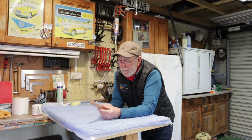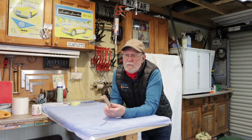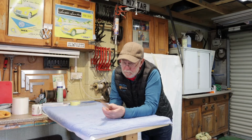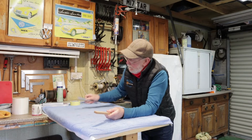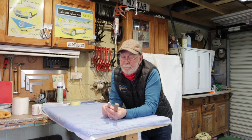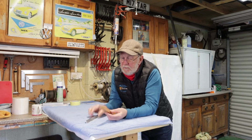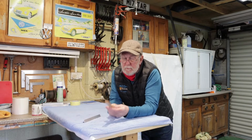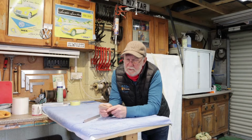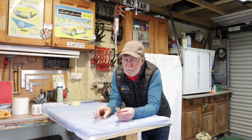Good afternoon. So here we are again now on our mini saving tips. So I'm going to try and make a spot leveler. The leveler is going to be made out of this T-section 2mm aluminium section. I need to make an angle for it. I'm not worried about the length at the moment. What I'm concerned about is I need to cut a slot in here 2mm wide to fit over this section.